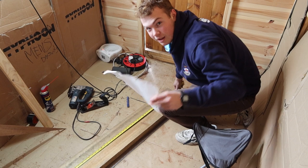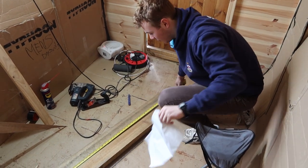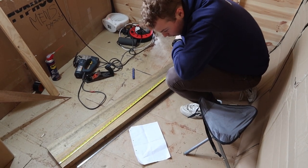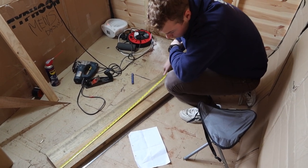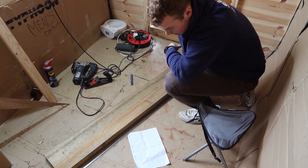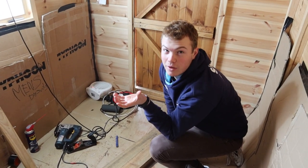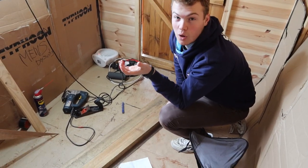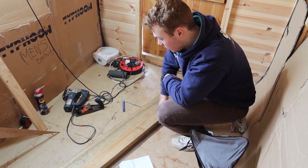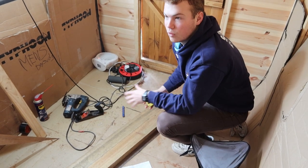So these are drawings for the original keel of our Pete's boat. What I'm doing now is just drawing out on top of our first plank the shape of the bottom of the original keel, which will obviously be the top of our new keel. Then what we're going to do is draw out the shape, cut around it, and make it the same on all planks.